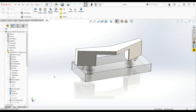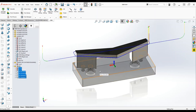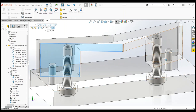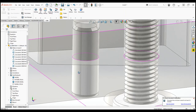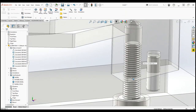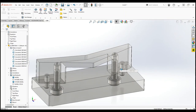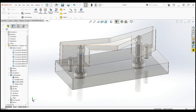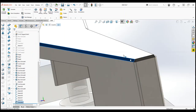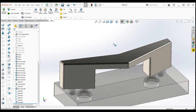There's one more small problem: locating the part. The CNC machine will always run exactly the toolpath you tell it to, but if the part is sitting crooked or out of position, the perfect toolpath is going to come out looking crooked on the part. To make sure the part's sitting perfectly square on the fixture plate, we're going to use dowel pins that fit into dowel holes with a very tight fit — only 1 thousandth of an inch larger than the dowel pins. You might think, why not just use the bolts to locate? The clearance holes for the bolts are 20 thousandths larger than the bolt, so the part could be up to 20 thousandths crooked. In this case the chamfer we're putting on the handle is only 40 thousandths wide, so the chamfer could vary in size by up to 50% — which is going to be really noticeable.